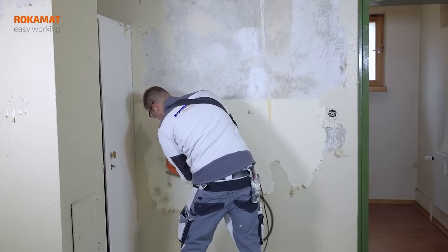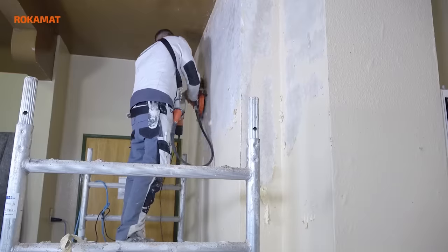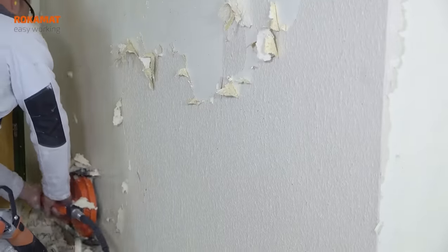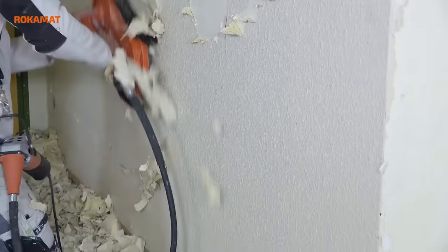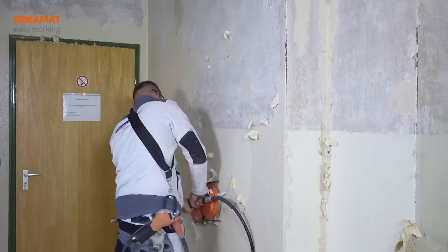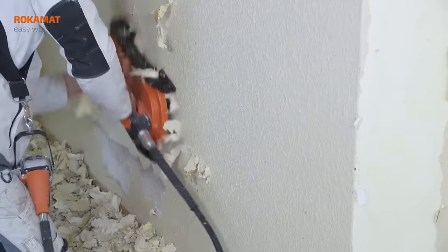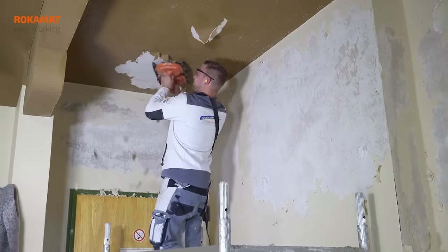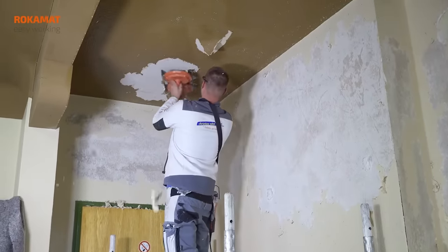Milling sand cement plaster, removing decorative plaster, smoothing concrete, stripping wallpaper, and cleaning glue residue are just some of the tasks that can be performed by this machine. Other features are its low weight of only 2.4 kg, adjustment of speeds from 120 to 600 per minute, its high strength, and the ability to use it along with a vacuum cleaner.